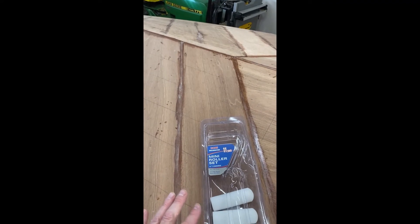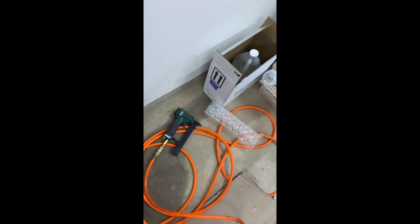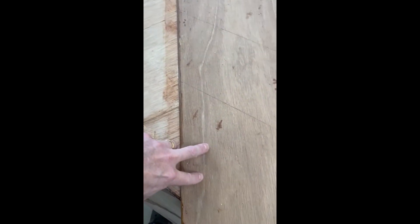I have the boards laid out in order — they're numbered — and I lay them one at a time. You can see where I have the battens marked. I use composite nails with my Omer nailer: the longer five-eighths-inch composite nails around the edges and where the battens are, where there's thicker wood underneath, and the smaller seven-sixteenths-inch nails in between the battens.